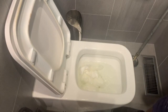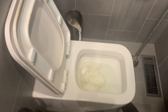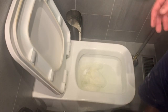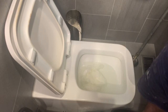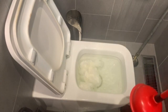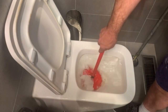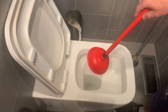The toilet is now blocked. In this situation, you can see it might slowly be going down. You obviously don't want to flush too much because it'll fill over the top, but you can add a little more water to build up pressure. Then get your plunger right into the mouth of the drain and push through — boom, just like that.